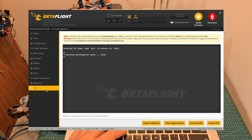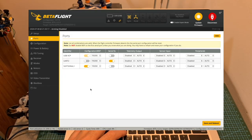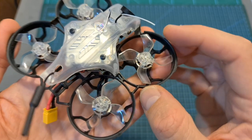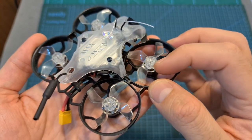So what I recommend to do before configuring the quadcopter is to head over to the CLI tab on BetaFlight, type the word diff, press enter, and save the results to your computer. I also recommend to save the dump file, which I'm going to include in the description box of this video, so in case things go wrong, you can reflash the flight controller with BetaFlight 4.1.6 and apply the default settings. By the way, another thing that you should keep in mind when installing the propellers is that out of the box, the motor direction is reversed, so make sure to install the propellers accordingly.